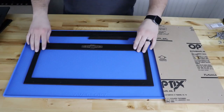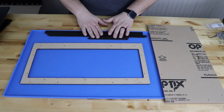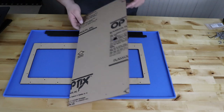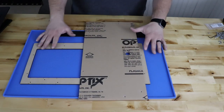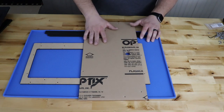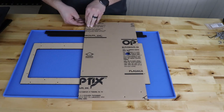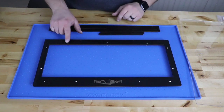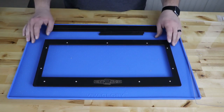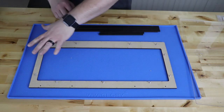Step nine is the lid assembly. We need the RepBox 2 lid, the frame pieces, and the acrylic panel. Be very careful — do not over-tighten anything because you can crack the acrylic. There is a support email if you do crack it where you can get a discount replacement. First, take the backing off the plastic. Then flip the cover over and install 11 screws in the screw holes, ignoring the very outermost holes — those are for the hinge. Carefully flip the lid over and work from this side.